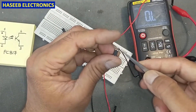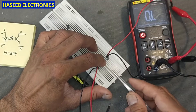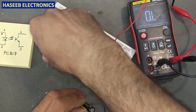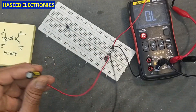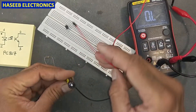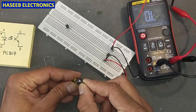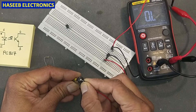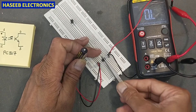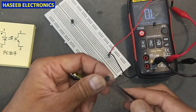This one is good. Now I will check this one — I am not using a resistor. If you have a new battery cell, you can use the resistor to protect the LED; otherwise with 1.5 volts it is safe. This optocoupler is not responding — no response. We can check another one — this one also has no response.